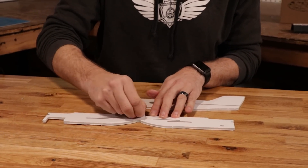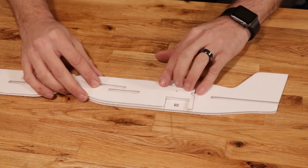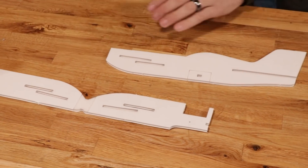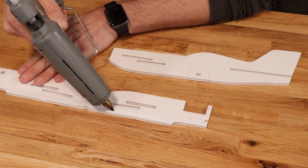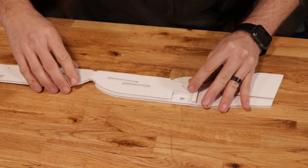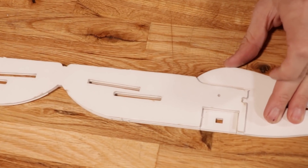Let's put our attention towards the main fuselage since everything fastens to it. To prep our fuselage, we need to remove the paper on the center section. We're going to do a quick test fit to make sure everything lines up properly — the cutout should be around our etch lines where our control board goes. We'll also line up the slot for our main battery and fore wing. Once we're happy, we'll flip it over and carefully put a little bit of glue all around the perimeter, then line it up again.